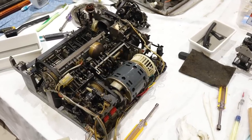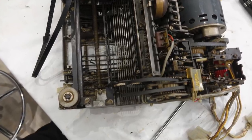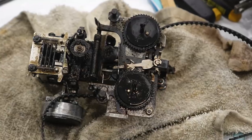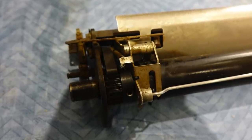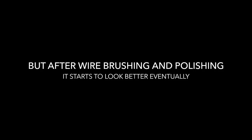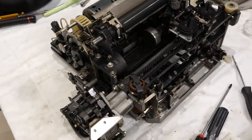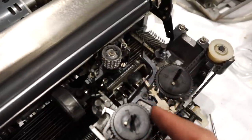This was the state of the machine after the first overall and quite thorough cleaning. The machine was still quite grungy and we had to take it down to its main sub-assemblies. There was quite a bit of rust on the tape punch, lots of grime on the code bars and the ratchet mechanism. The printhead was really bad — really grimy. The platen assembly had concerning pitting rust that did not go away with regular cleaning. A lot of the work on the carrier was all rusty. So I took the carriage out and cleaned it entirely.